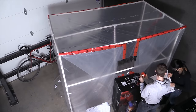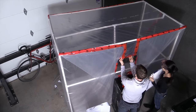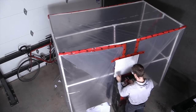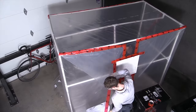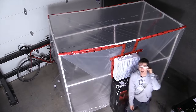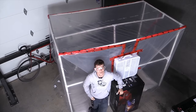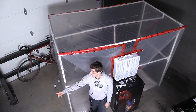And that's pretty much it! One trip to the local hardware store and two hours later, we've got ourselves a DIY paint booth suitable for small, hobbyist-grade projects. Please note, though, that if your intention is to use it more than occasionally, or with oil-based epoxies and paints, you should invest in a couple of fans that cannot ignite flammable paint fumes and just generally have a beefier setup overall. But this is great for what I need, and I'm glad you came along for the ride.